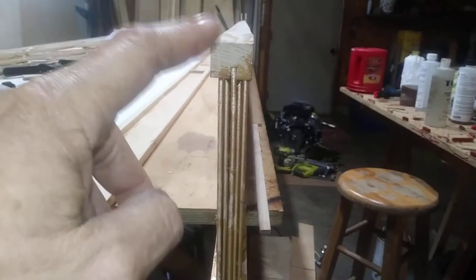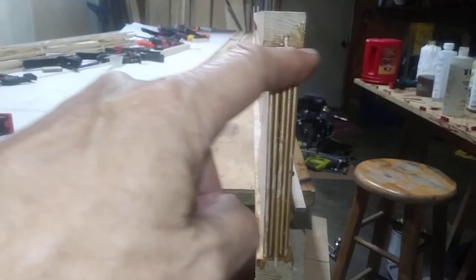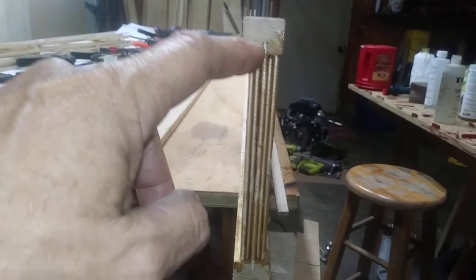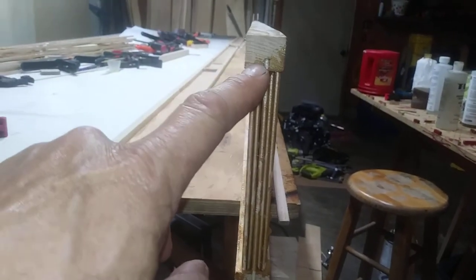So you want to make a wooden spar. It's pretty simple. Cut your rib caps — usually three-quarter by one inch wide. Usually the grain goes the other way, but I'm doing a geodetic wing, so that doesn't matter so much.